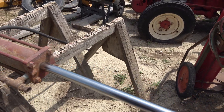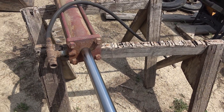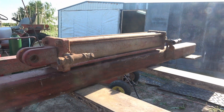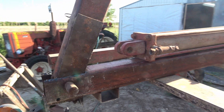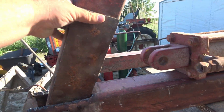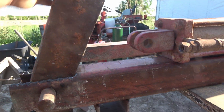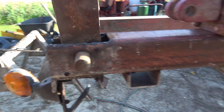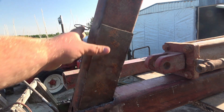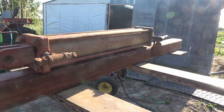I got it a while back and it's been sitting in an old shed, so I don't know anything about it. We're hoping it's good — if not, I have some other ones we could probably use. After a whole bunch of cutting with the torch, I got this thicker box steel freed up from the old loader frame. I've changed up plans because I found I can use these joints here. This is the original loader arm that's been cut off, and I'm going to use it for my joint for the thumb. It can hinge all the way down and back up. I'm going to cut this back so it should work, then get this cut to length and weld up this piece of box steel for the center of the thumb.